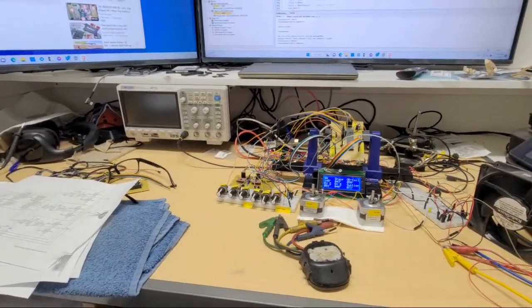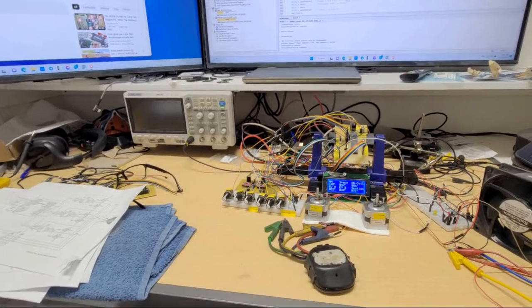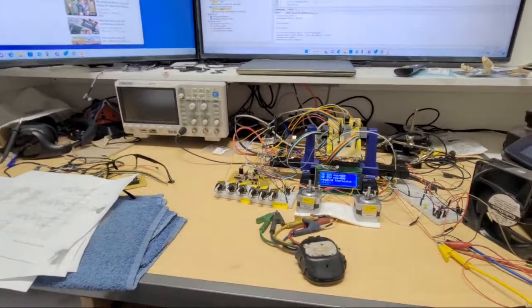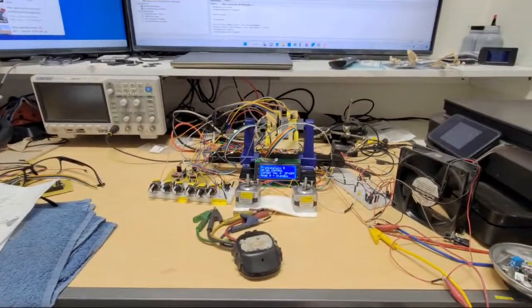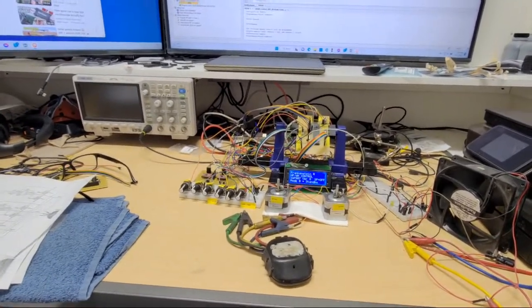Watch those diodes get kind of hot, but I think I could take that exact thing I have there and just put some better diodes on there, maybe some with some heat sink. And then even double up the capacitors, if I ever need, on that same design to run something like a small compressor or something. Be kind of cool. But it seems like that thing right there was pretty robust.